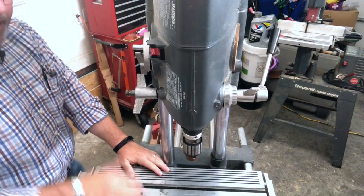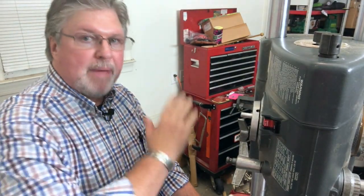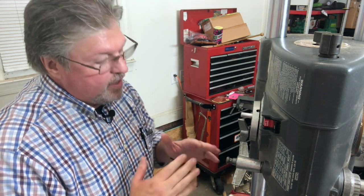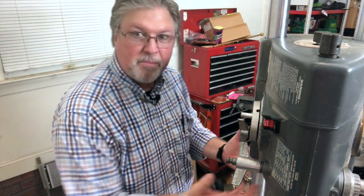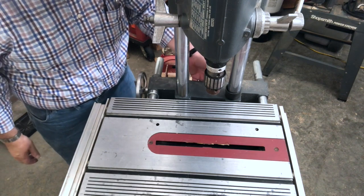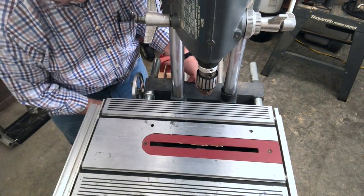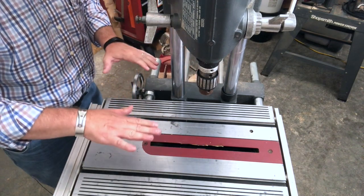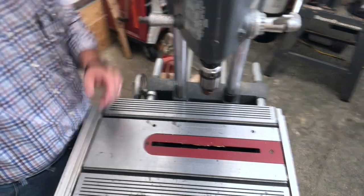If you needed to adjust the height of this table or the height of the headstock, the ideal thing is to lay it back down and adjust it while everything is horizontal. If you needed to, you could move the headstock up — you just want to begin by gripping there, loosening, and then lift it from the middle of the headstock. The weight is centered right there between the tubes, so you can lift it easier there. Same is true of moving the table up and down. If you grip it here at the center of the carriage before you loosen, you might have to lift on the table slightly because the weight of the table, grip fence, jigs, and fixtures is putting this in a little bit of a bind. Best yet, smartest thing — just go ahead and lay everything back down horizontal.